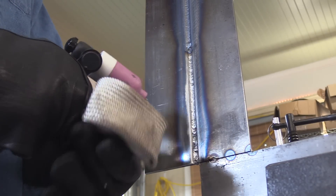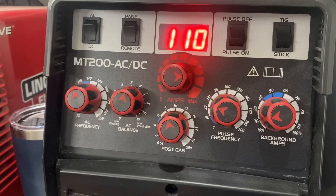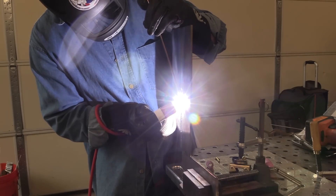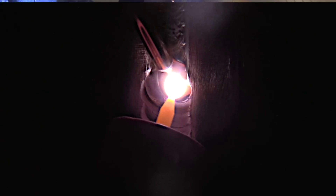That's the hot pass walking the cup — it went in pretty good. I wound up being just a little bit lower than I'd hoped, so I might need an extra pass before capping. Now we're going to do the freehand hot pass. I'm going to use the side of the tig finger that's got the most layers on it and slide right on up there. 110 amps, still full pedal. The motion is very similar to walking the cup, and oftentimes I can carry a little bit more metal freehanding than walking the cup. This looks like it's filling up just a little bit better. I'm weaving it evenly, watching the toes of those welds where the metal just flows to that line where the bevel is, to leave myself a straight line to cap.